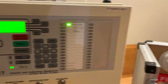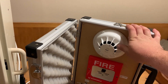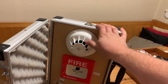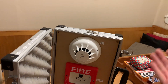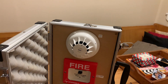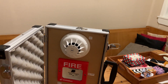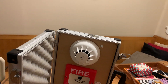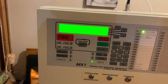Something else I want to demonstrate is the smoke detector. I've set this up with user logic to be type 5 when it first starts, and if you do not reset the point within 30 seconds it will go into full blown evacuation. The Tyco MX1 devices have really good algorithms in place to prevent false alarms, so in order to test this device efficiently during BWF inspections you need to put it into something called commissioning mode - the whole panel goes into commissioning mode.